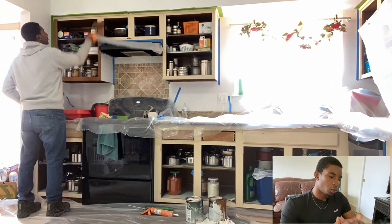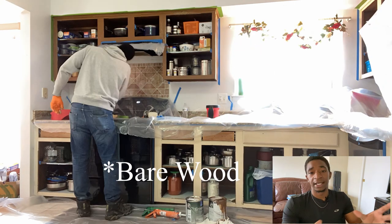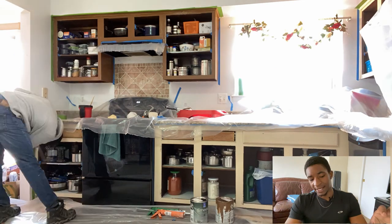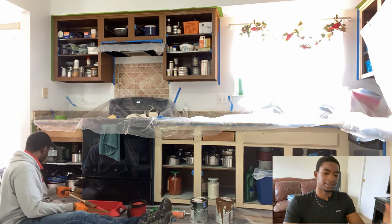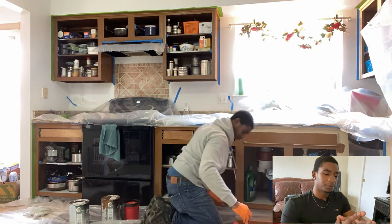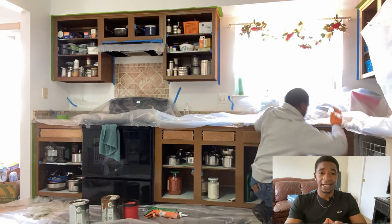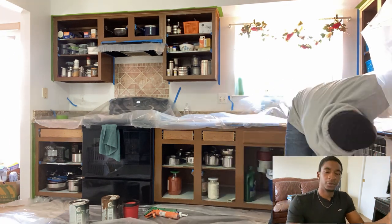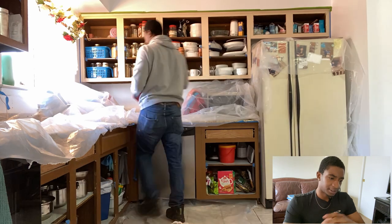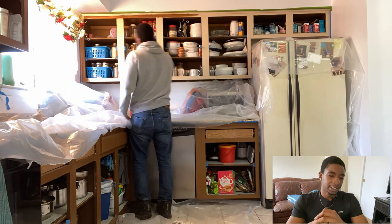The customer originally wanted a natural look — he wanted to bring it back down to regular paint and then stain it. For the price I gave him on this project, that just wasn't going to happen. I told him, look what I can do: I can find a paint that kind of resembles natural wood — I think it's umber rust or something like that — and apply that, and it'll give you that result without going through the nasty process of stripping the paint off the cabinets or spending two days sanding all the paint off. So I'm just filling in here, applying the paint, and wherever I make little mistakes I keep a rag close to hit that right away — no problem.